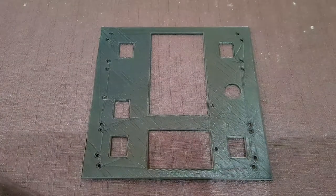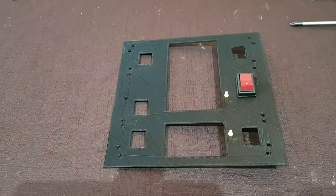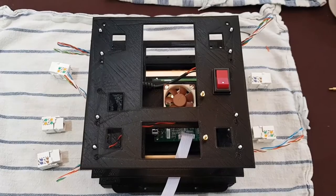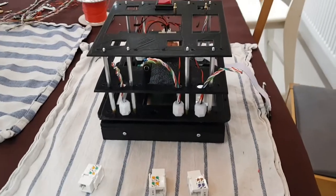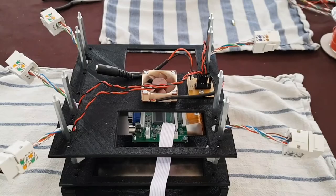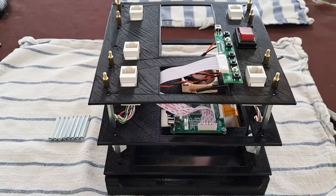As well as this switch we also have the keystone jacks that the wiring will plug into at the back and then click into the rectangular cutouts. There are also two small spacers in place ready to hold the physical input buttons for the LCD screen should you not want to use a remote. With layer 6 in place I start feeding the wiring into those keystone jacks. I removed layer 6 temporarily to get a bit of extra space while using a punch down tool. Then I pop layer 6 back on, click all the various connectors in place, and the unit is now completed.